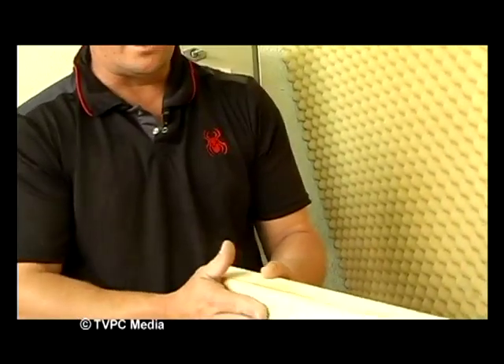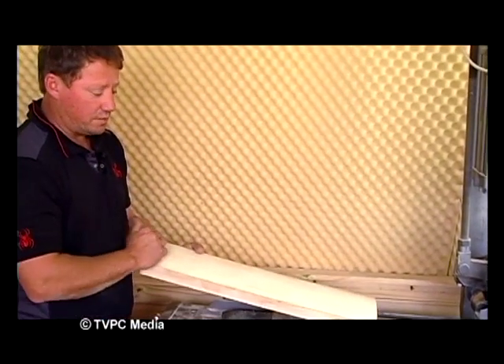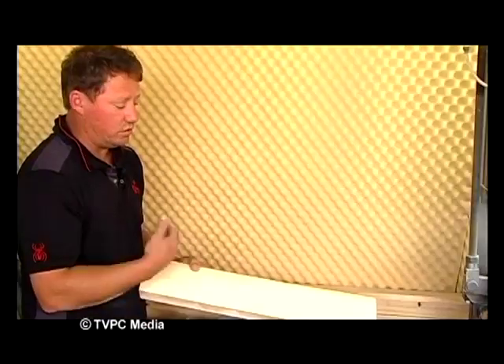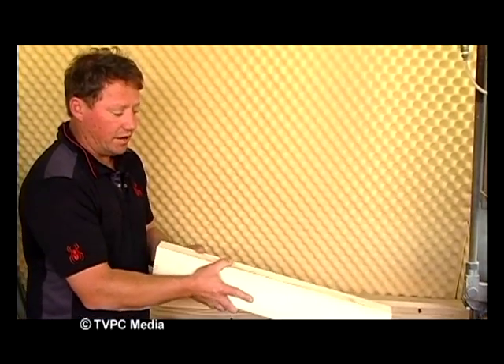We use a different technique to most other companies. I won't fully press it now — I'll slightly under-press it. Once we've spliced it and put the handle in, we will then oil these and in about a day or two's time we'll come back and repress them to where we feel they'll make a really top bat.